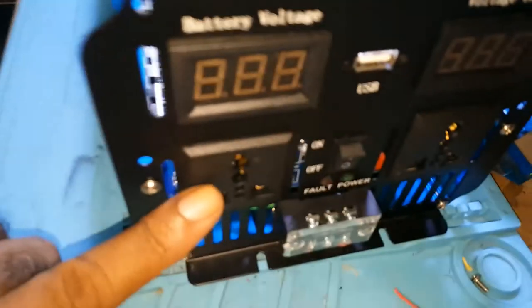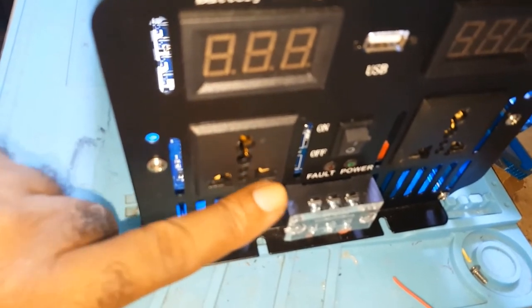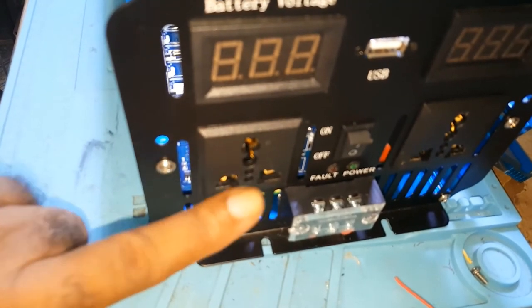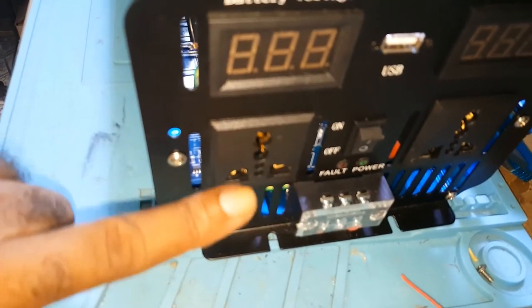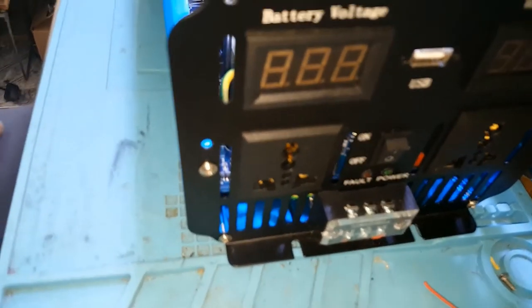I left the red cable, but to the outlets I have the right color going for live and neutral. But either side of these outlets alive, that would make 115, 115, so you have 230 output here.